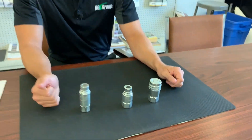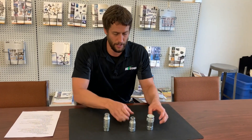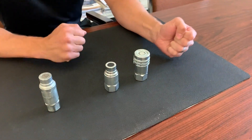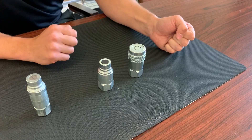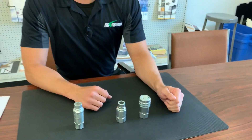There are some upcoming changes to this line coming in fall 2020 for the three-eighths and half inch. They will come standard at 5000 psi, which gives you a higher pressure option, along with improved corrosion resistance. Sleeve lock will come standard on the FEM 371 and FEM 501, and as we move along there will be more sizes that will adopt these changes.